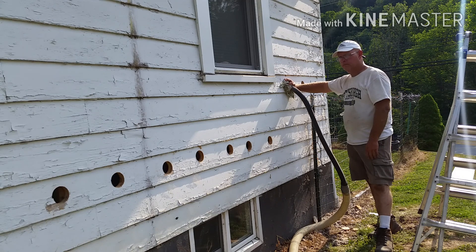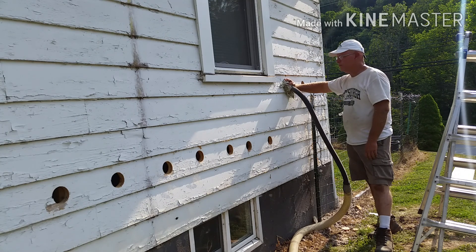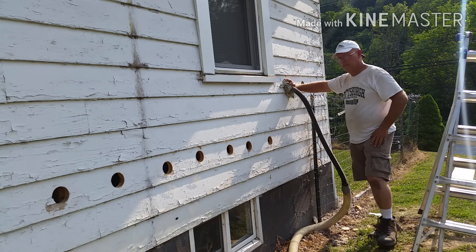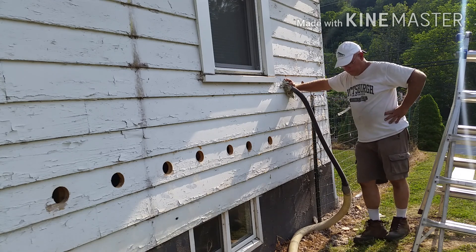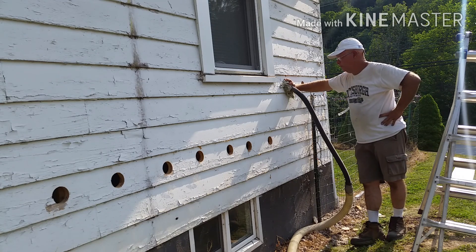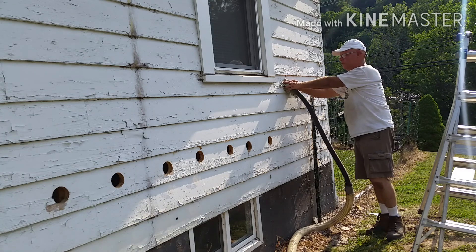In true Viral Workaholic style, we started blowing insulation into the outside wall of the bathroom. We checked — no insulation going into the basement, no insulation going into the attic — so we continued to blow. The more we blew, the more it took. We stopped again, checked, and found we had insulated underneath the bathtub. So always pay attention: if you're getting more insulation into a cavity than you think you should, there's a good possibility it's going somewhere you didn't intend.